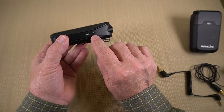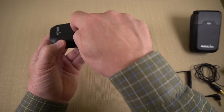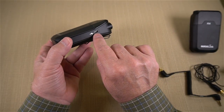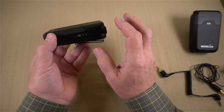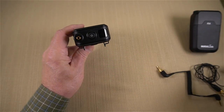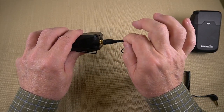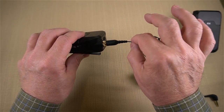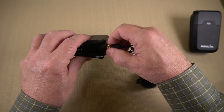On the side, there's a micro USB connection for external power — any external power source with a micro USB cable works. You can also use internal batteries. The unit is smart: if external power is connected, it uses that first; when you disconnect it or run out of external power, it immediately switches to the internal battery, providing redundancy. On the front, there's a three-and-a-half millimeter jack with a locking collar for the lavalier mic — tighten it up and it won't accidentally pull out.